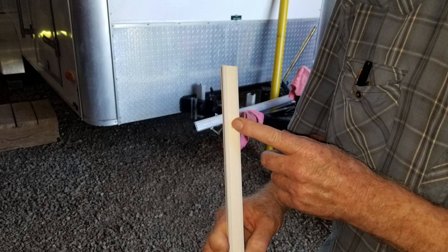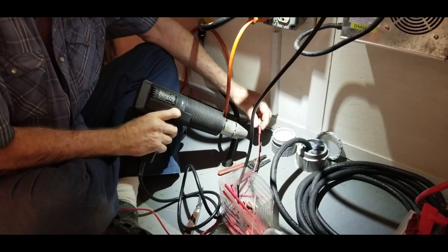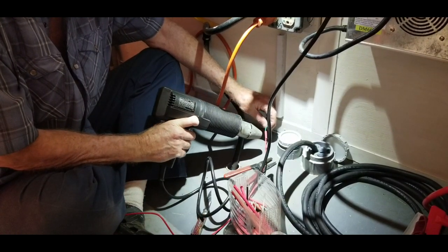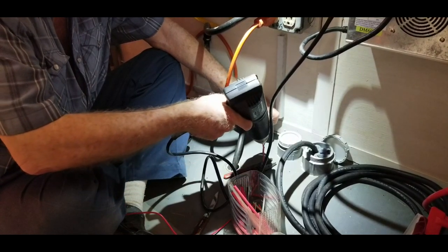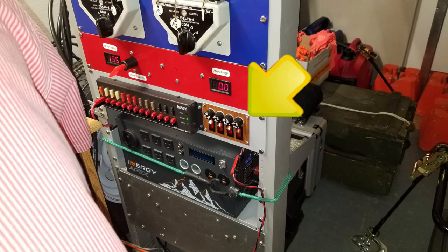In some of these next photos we also did some more electrical work in the trailer. We prepared some conduit, measured and drilled holes for mounting, and ran some additional conduit. We're still fleshing out additional switches to give us capacity now and in the future. We've been putting in additional wiring and trying to do a nice, neat, clean job of it — using heat-shrink tubing and conduit to make the job neater but also safer, keeping wires out of the way. We added some additional conduit, put in switches by a power distribution point at one of our stations, and also added a four-gang switch over in the rack on the other side of the trailer. You can see the yellow arrow pointing to those additional four-gang switches. We've got plenty of expansion room.